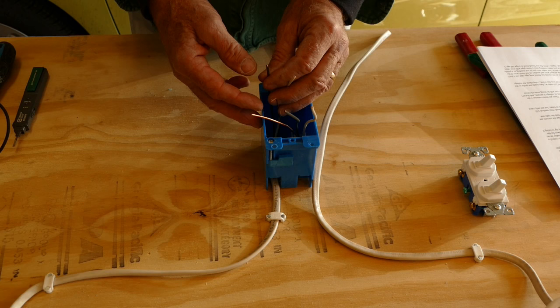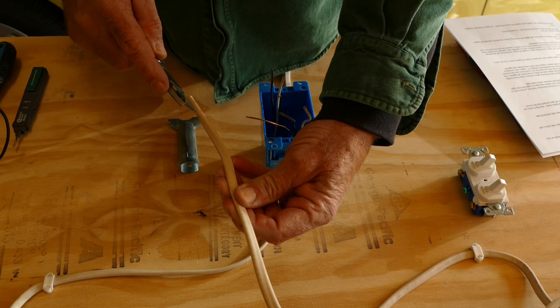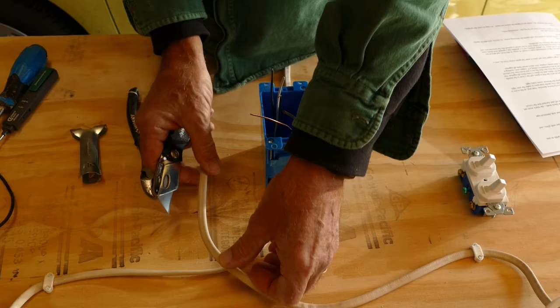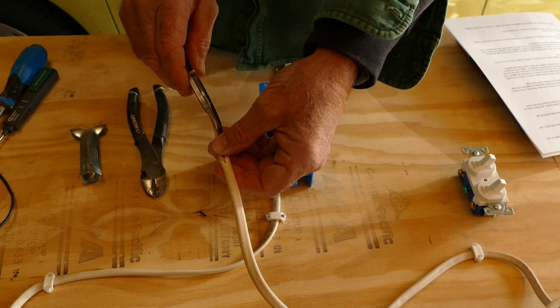If you're running wire to a new lamp, you'll need to strip the sheathing off the end of the Romex or NM wire where it enters the wall box. Usually about 6 inches is the right length. Many electricians use a knife or box cutter. Run the knife down the center of the Romex and the sheathing can be peeled off. Just be careful not to let the knife get close to the edge or it'll nick the insulation on the white or black wires.